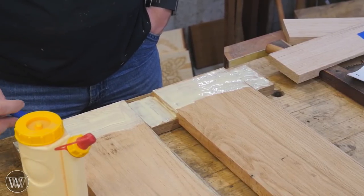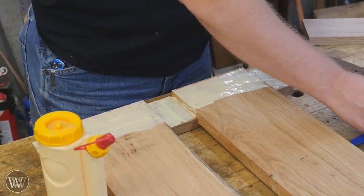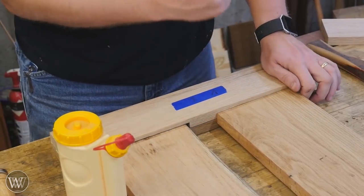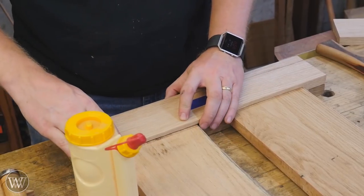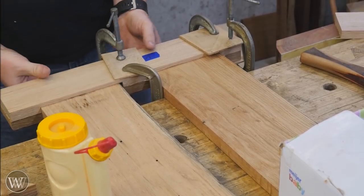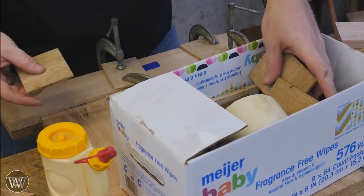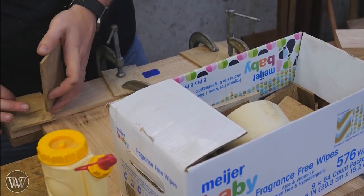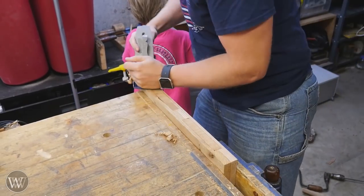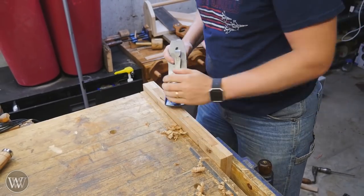Then we can move on to gluing. I use a fairly heavy amount of glue — I'm not afraid of squeeze-out because I can always trim it off. The surfaces are a bit rough, but I left them somewhat tight so they take a little bit of popping to get in place. Then we can clamp it down — C-clamps work fantastically. For the cauls, I actually use some of the cut-offs from when I make tenons. The cheeks you cut off when you cut out a tenon — I save all those because they make really great gluing cauls. Then I can put it back in the vise and smooth it down and make it ready for the next step.